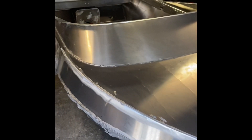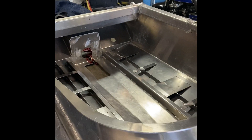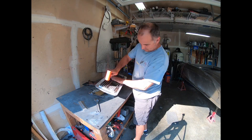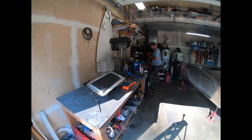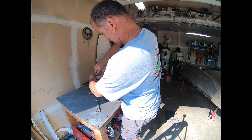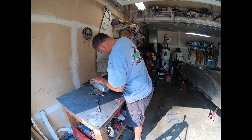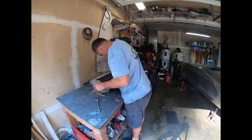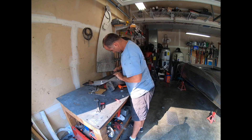The boat's looking good. Not much left on the bottom and we'll start mounting stuff on the inside. Getting the pump ready for install on the bottom of the boat — the three main parts are the actual intake bars and then two wedges, one up front and one in the rear, that get bolted down with nice countersunk recesses so it's flush to the bottom of the boat. It took a little bit of time — had to coerce it with the mallet and work all those bolts to get the wedges to suck down nice and tight.